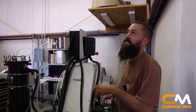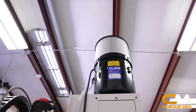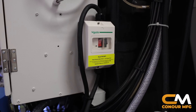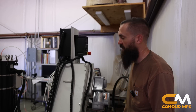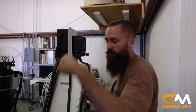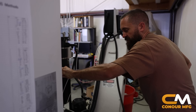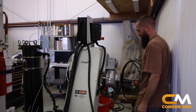A few of the other add-ons to this machine: you've got the Royal Mist Collector, the controls forwarder right here — not super ergonomic, but it works. This prevents me from smoking out the shop and the whole shop smelling like cutting oil. It reclaims the cutting oil, and then in this little line here it condenses it and drops it back down into our coolant tank, which is cool because cutting oil is expensive.